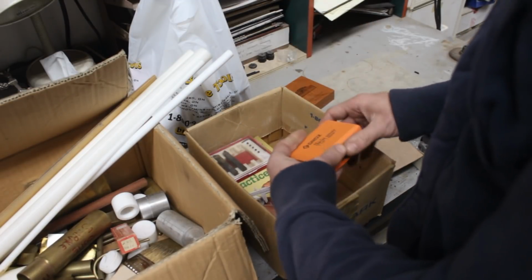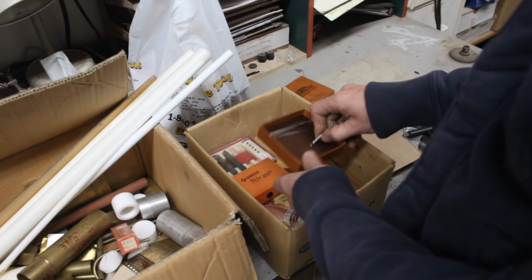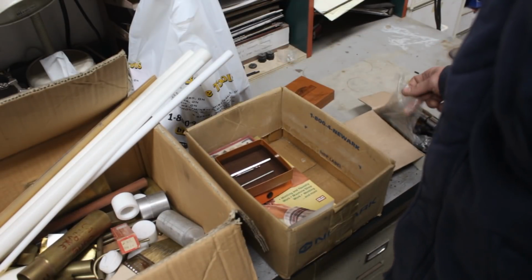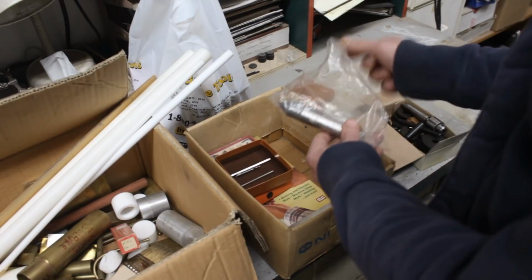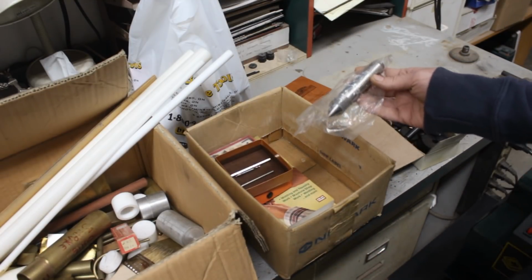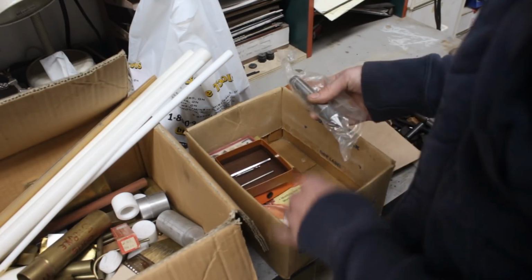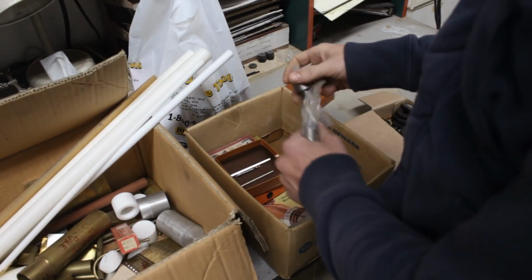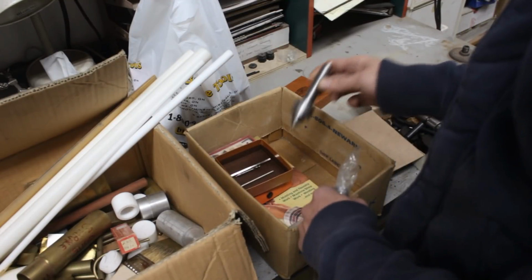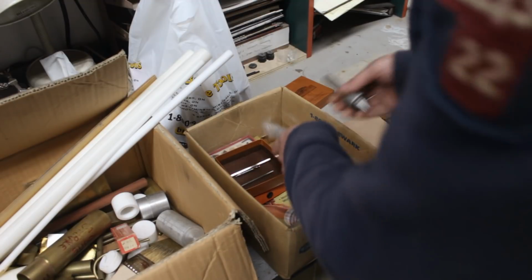So that's here, the Allen keys that I need for the chuck and for various parts of the lathe, a center drill, just one. This is a dead center, but this is not for the tailstock, this is for the headstock actually, because it is Morse taper 3, which matches the spindle taper. But I also have this live center, which turns, and it is Morse taper 2, which matches the tailstock taper, so I can do work between centers if I want to.